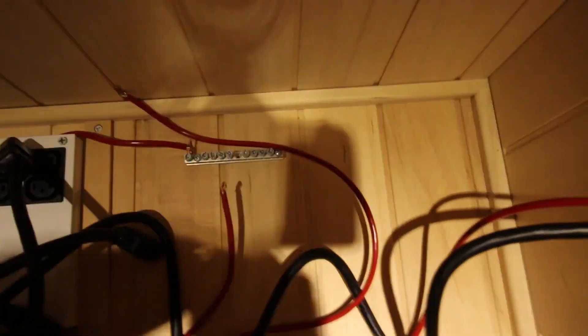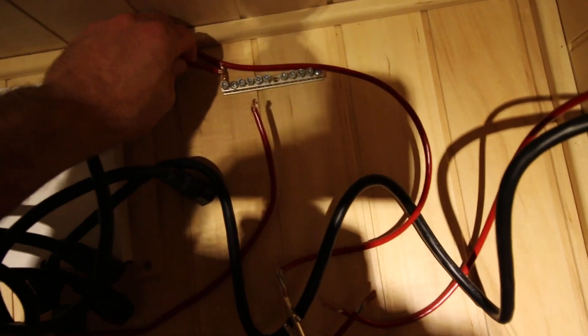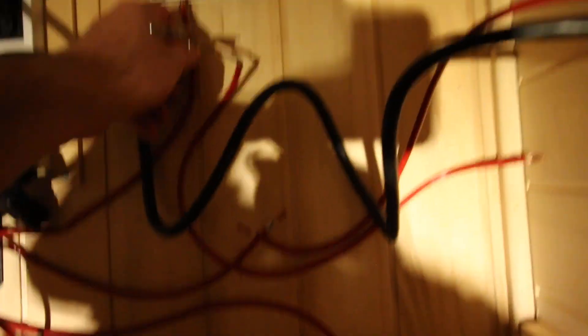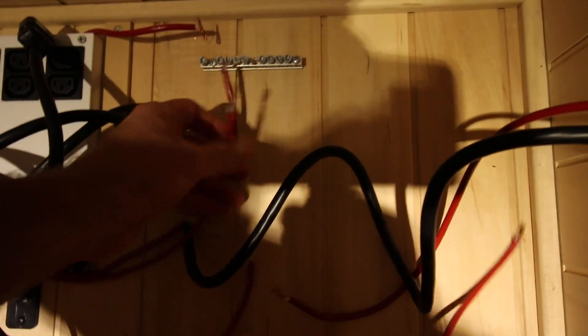The way this works is you've got a ground block down here, and all I did was pull a ground off the master ground from the power supply so we're not reintroducing any additional ground loops. Then I've got a wire that goes to each heater shield — each one of these has its own screen. The left one has its own, even the front one has its own. All you do is attach each one of these wires to the ground block, and that will activate the Faraday cage in front of each one of them.